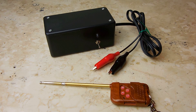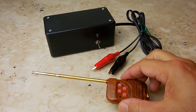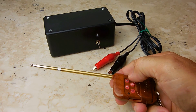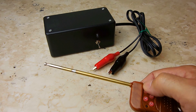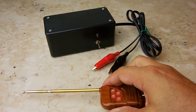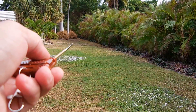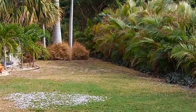The first thing I'm going to do is a simple test — I'll hook up a 12-volt test light, hold the remote control, push letter B, and you'll see it turn on and off. Remember, this is momentary: it only stays on as long as you hold the button. If you wanted it to stay on when you release the button, you'd need to use a latching relay inside the unit. I prefer momentary. The receiver is positioned way down over there — we're going to push the button on the remote and see the light come on.